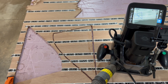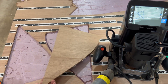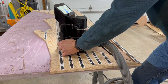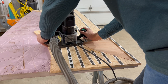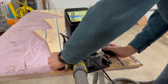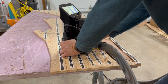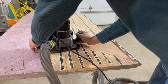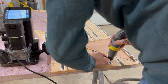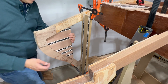Each filler is supposed to be three-quarter inches thick. So what I did is laminated first a quarter-inch filler, and then a half-inch filler. I cut the half-inch plywood with two passes. With this method, my fillers fit really well.